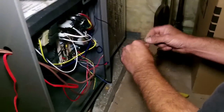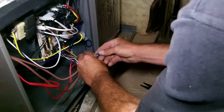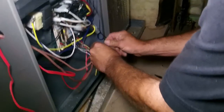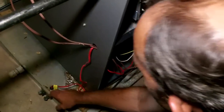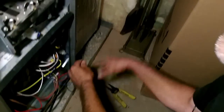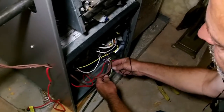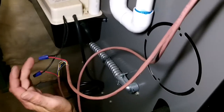I'm going to grab the wire now, and we'll attach this wire back. So like I said, what I just did — the float switch in the pan: the wire leaves the red terminal, goes into the condensate terminal on the circuit board, comes back, goes through the float switch there, comes back, and goes up into the secondary float switch up there. Leaves there, comes back, goes into the red wire going to the outdoor unit. Then it goes to the condensate pump, leaves the condensate pump, comes back, goes outside.